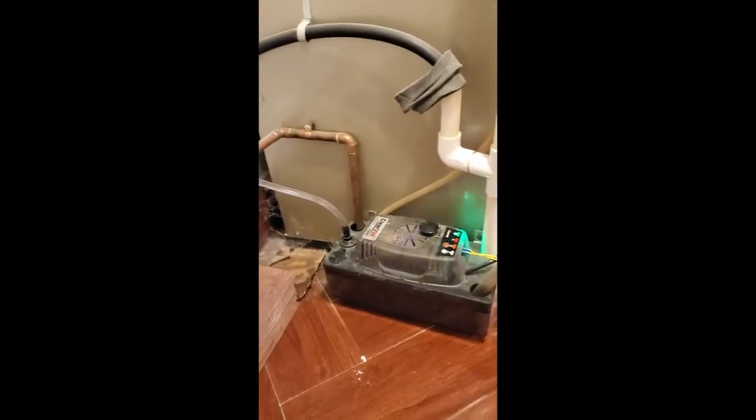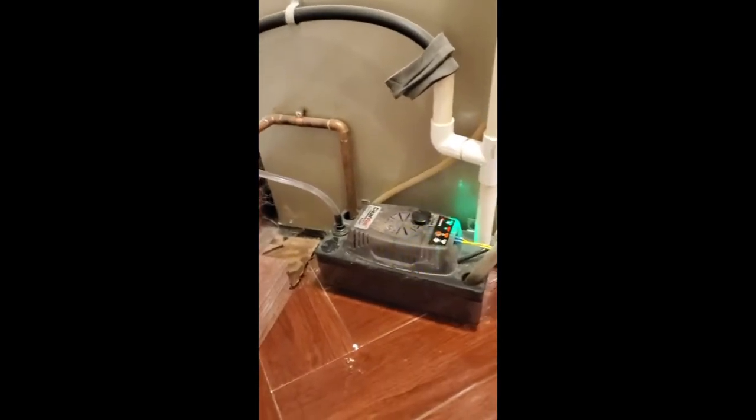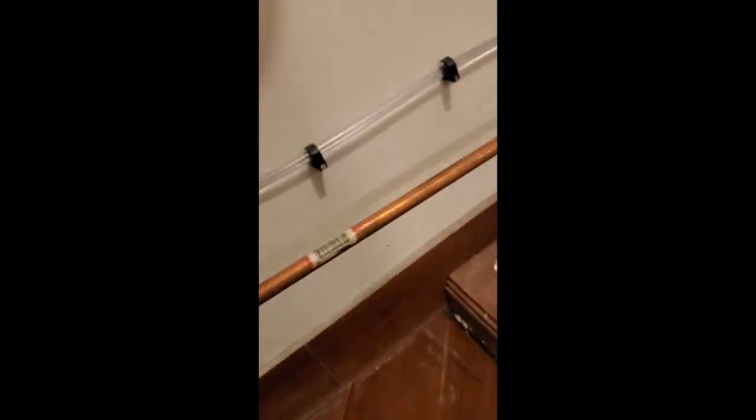Finished product, we're all done and cleaned up. There's our condensate pump — already existing — and our new condensate line. We came up running along the wall, up the wall, tucked back behind the pipes to hide it. This is the section we opened up to get to the standpipe. We came across the top, looped it around, and it goes back into our fixture waste.